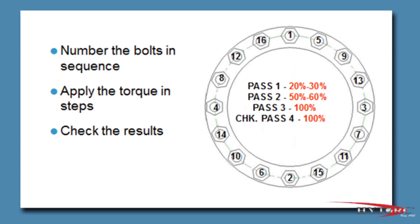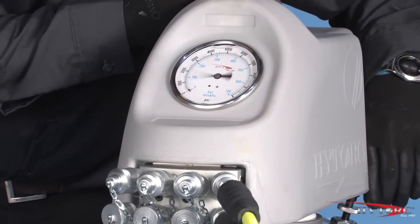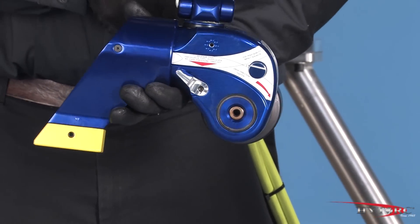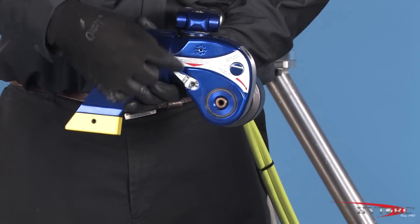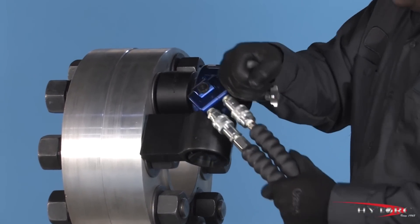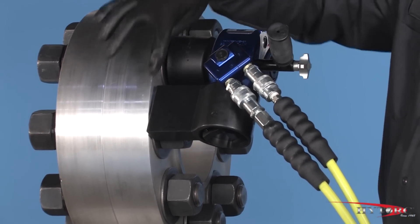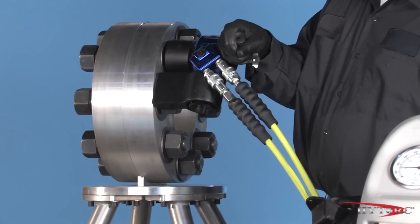Reset the pressure in stages until the final value is reached. But for our demonstration, we will simply tighten to the target torque without any intermediate steps. With the pump set at 3,400 psi, we are ready to go to work. The socket and drive should be inserted so that the word 'tighten' can be read on the opposite side of the tool. Since the drive is offset from the piston inside the tool, when viewed from above the socket, the advancing piston will turn the drive and socket clockwise, tightening the nut. Attach the safety handle to avoid any pinch danger. Place the tool on the application, checking to make sure that the reaction point is secure, the wrench is fully engaged, and the hoses are not in danger of being kinked or damaged. Note that the reaction arm should be rotated so that it rests against an adjacent nut in the same plane as the nut to be tightened. It is a good idea to bump the control button before starting to tighten, just to check how the wrench will react under pressure.